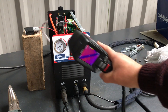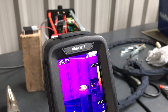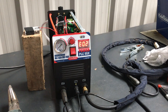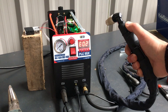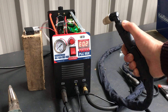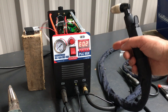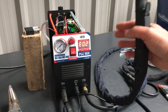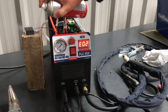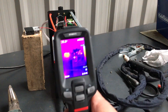Right, it came up with the overheat error — Error 2 — and that's about 90 degrees. So let's see if it will spark up — nope, it will no longer spark up, and it's just flashing Error 2. Now it's locked out until that cools down; until you power cycle it as well, even if you cool it down, it won't actually come away from this error — at least that's what I think. Still Error 2.